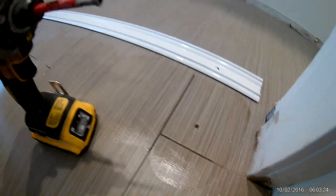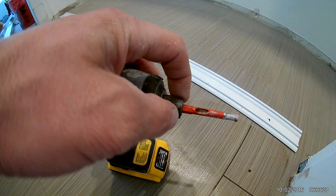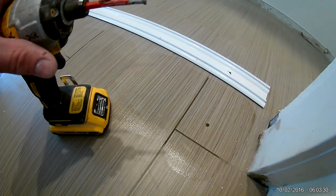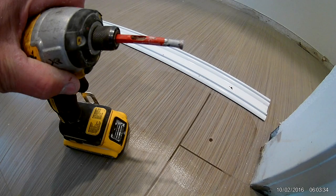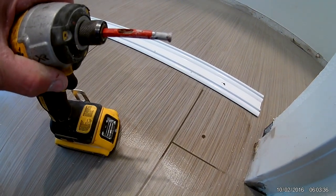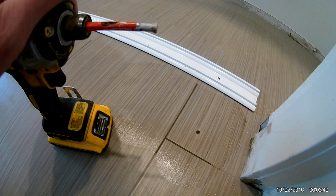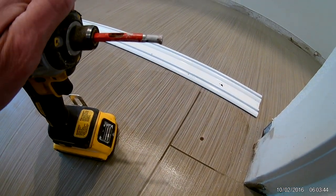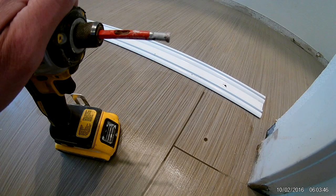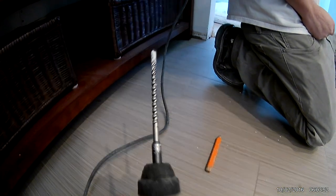That was the quarter-inch diamond hole bit that you can install in your impact gun. We like this one better — it drills the hole extremely quickly. Obviously make sure you keep water on the bit as it gets very hot. Only time will tell how long it'll last and how many holes it will drill into hard porcelain, but so far so good. We prefer this over the masonry bit for the rotary hammer.